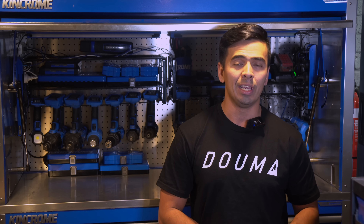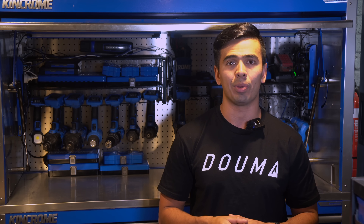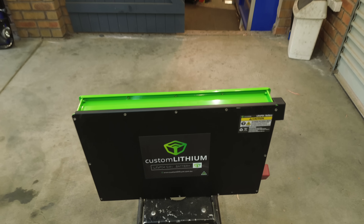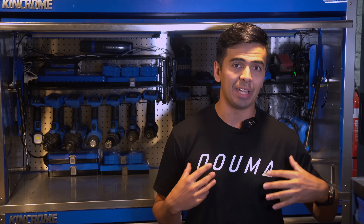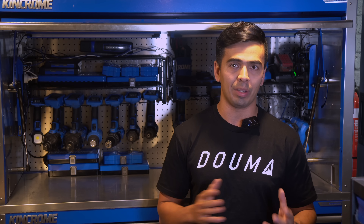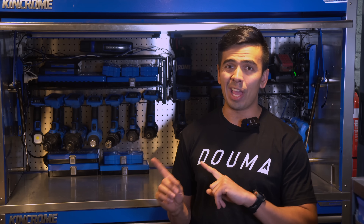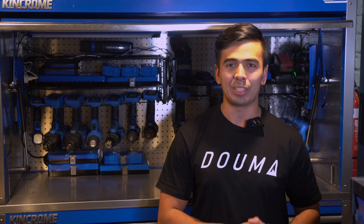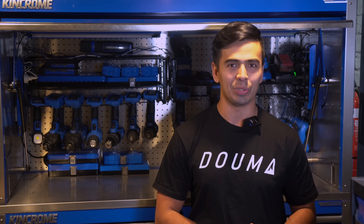In conclusion, my absolute minimum battery capacity recommendation for induction cooking is 300 amp hours. This Custom Lithium battery does a cracker job of it, and it has a 330 amp constant discharge rate - something I didn't have in my old setup - which is absolutely necessary if you want to run things like air fryers and induction. My opinion on solar: I'm still out on it for my use case. I do think it can work in certain scenarios, but since I barely camp in the same spot two nights in a row I don't think I'll get much benefit. I hope that has helped anyone building their own 12 volt system - 300 amp hours minimum if you are running induction. That's my recommendation. Hit like and subscribe if you enjoy this sort of content.